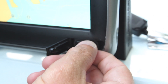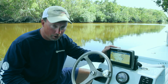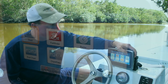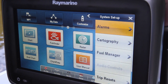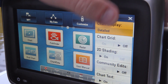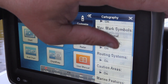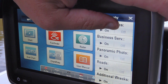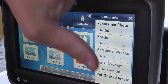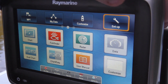Once you buy the chart, you simply put it into the unit, and you want to make sure that your satellite overlay is turned on. So you want to go to your home screen and check under Setup. We're going to look at Setup, check Cartography, and scroll on down to the bottom where we have our aerial overlay. This is a satellite overlay, so you want to turn the aerial overlay to on — to land and sea, or just on land. But because we're doing a lot of these creeks, we want land and sea to really show up all of the waterways.